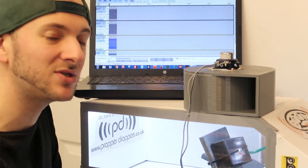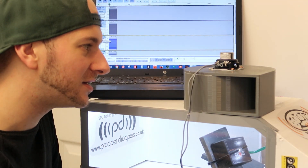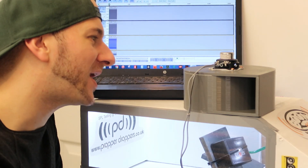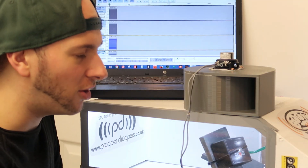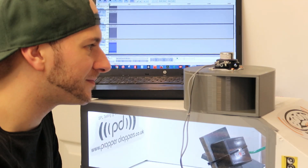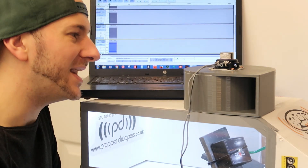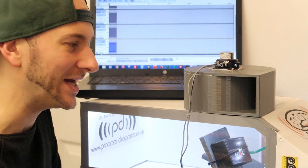Let's try the next one — 270 Hz is the first one where it's supposedly loaded. Oh yes — more power draw, less excursion, and a lot more displacement out of here. Lastly, 360 Hz: barely anything coming out of here and it's drawing quite a bit of power, so I don't think that's going to be very loud either.